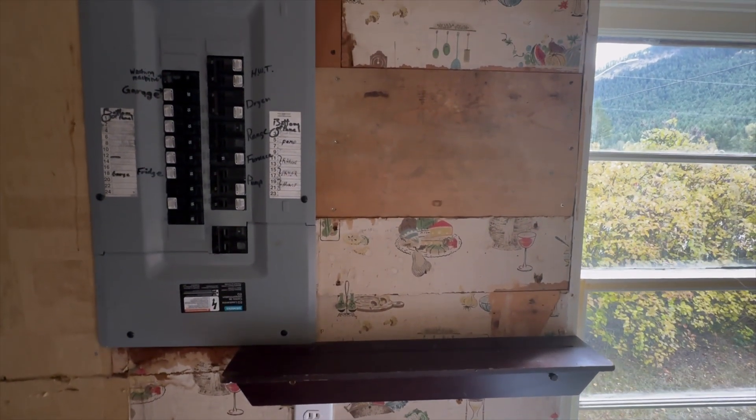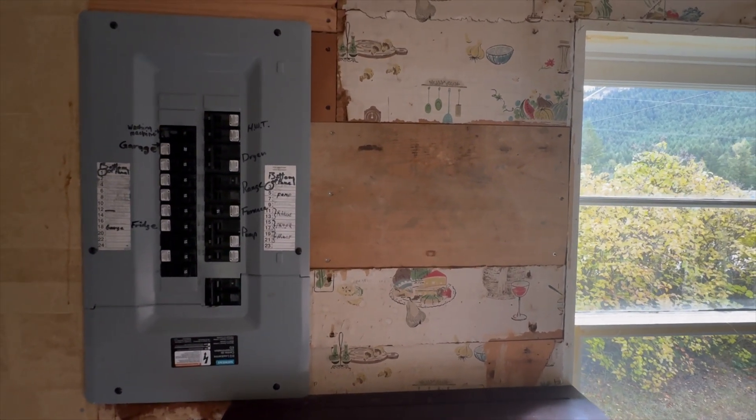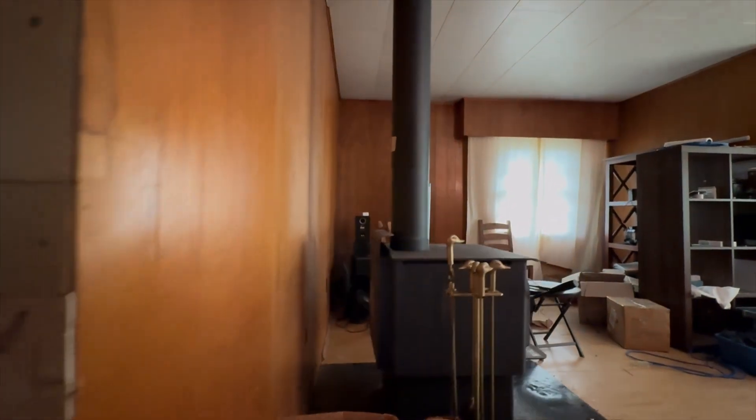You can see that at some point the main panel was updated — I'm guessing '60s or '70s. They're Siemens QP breakers with a 100-amp service; I'm okay with this for now. Back to the walls — the one-by material is covered with this door skin. Every room in the house is this door skin, with the exception of the living room which has state-of-the-art trailer park wall paneling. There is not a lick of drywall in this house.